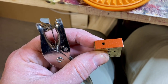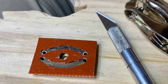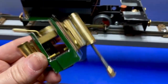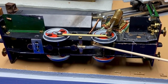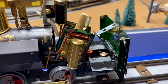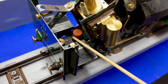I'm using a tiny hole punch to make gaskets using a piece of silicone. Here is the vertical engine — when I get the spacing right, these would be bolted together. Right here is an alcohol burner tank and the burners. I cut it here and added in the silicone hose. I put a Meccano bracket on here, drilled a hole through there for that, and this is a dogleg lubricator. Down here is where I fill the alcohol tank.